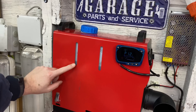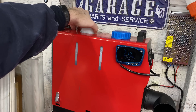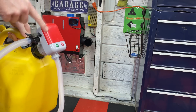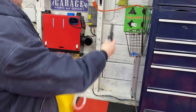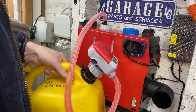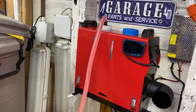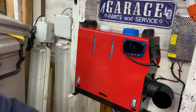When it comes to fueling this unit, it's pretty simple. You can actually see through the slots on the side what the fuel level is. The tank is movable in there — it just sits enclosed by this cover. What I have is one of these tank top pumps from Amazon. Runs on 4 AA batteries and has an optical pickup in the bottom so that when the tank is full it automatically shuts off. You just hit on and you don't even have to get your hands dirty. I'm running colored diesel — we call it farm diesel — about 20 cents a liter cheaper, around $2 a liter versus $2.20. Just let it fill up to the top and then let your diesel drain back down into the pump — never need to get a drop on your hands.